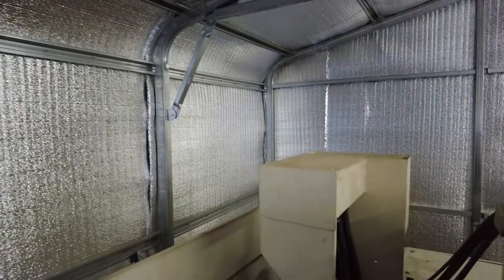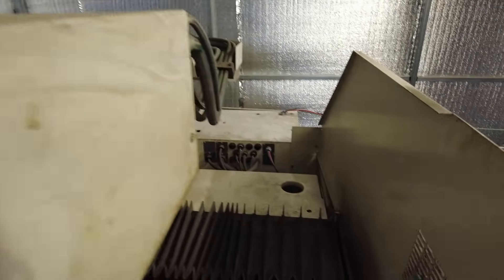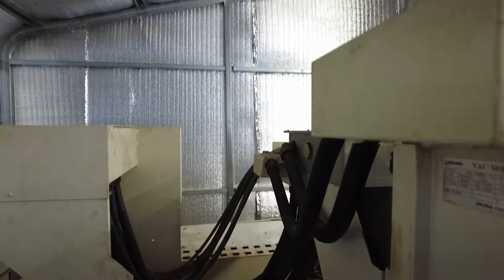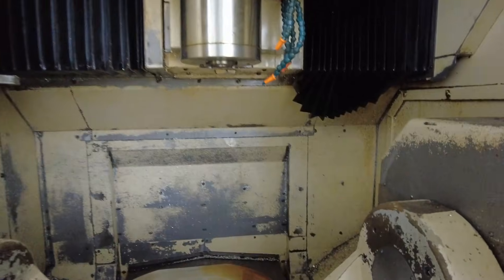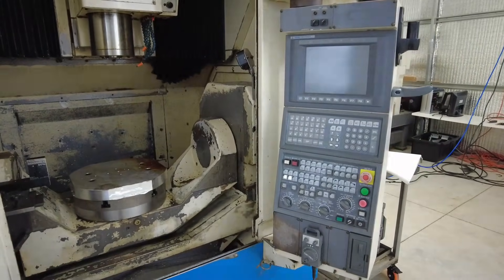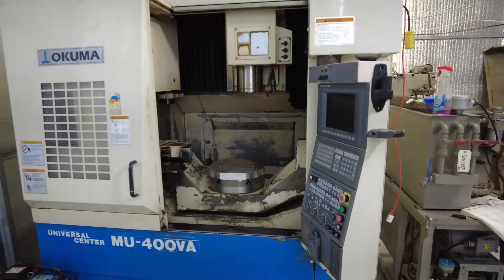This is kind of what the machine looks like up top — there's a lot going on, a lot of metal, big bellows. Inside here is where the spindle actuation and all that happens. As you can see, there's a ton of routed cable lines and hydraulic lines. I'll also be doing an oil change on the gear here for the hypoid gear, and there's another one on the side. Change that out and give it nice fresh fluids — want to make sure I've done my due diligence there.